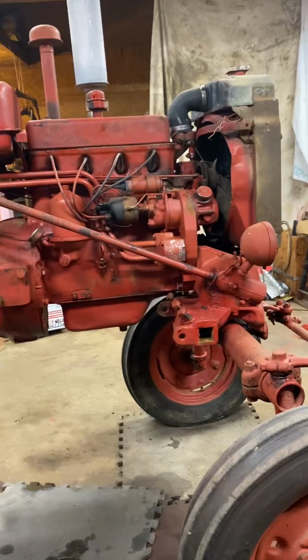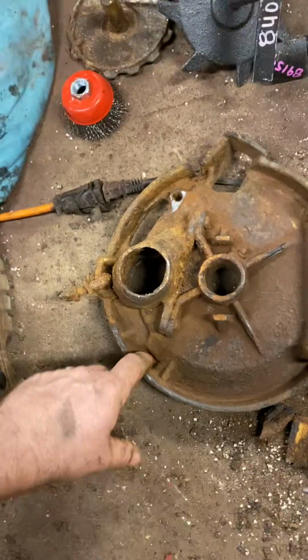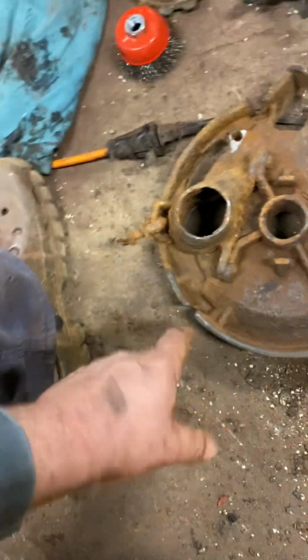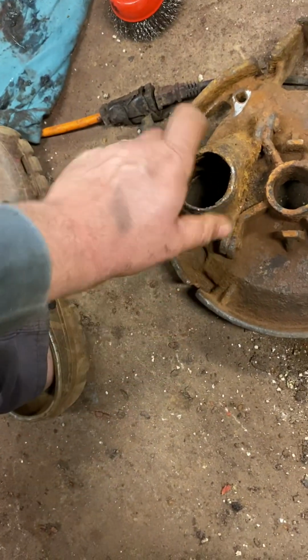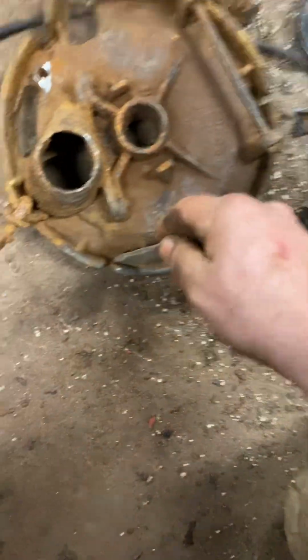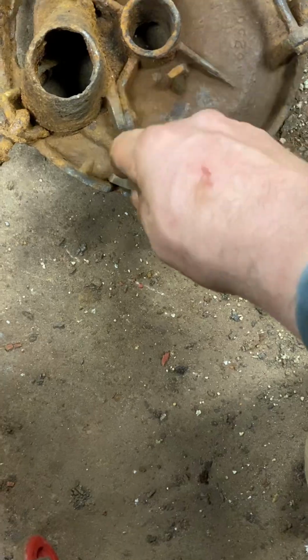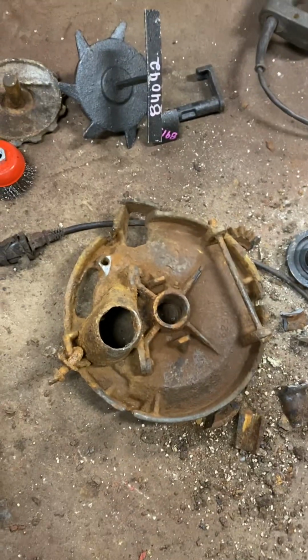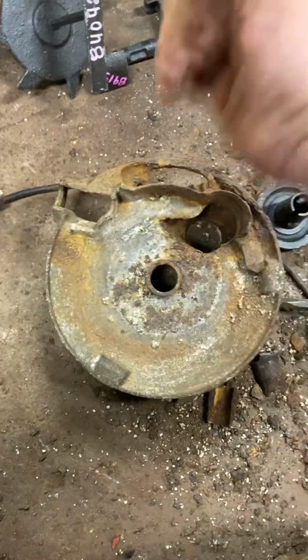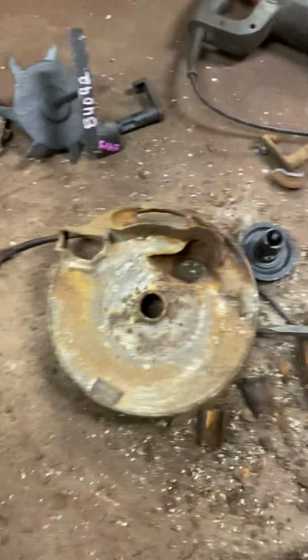Anyway, that's how you get it apart. And these bolts on the side to hold the hopper on there, flip the hopper upside down. Just take the chisel right there, the bolt and nut. Take the chisel, knock the heads off. And flip it back over. And take your block of wood and hit down on top of this. And just let it fall right out the bottom.